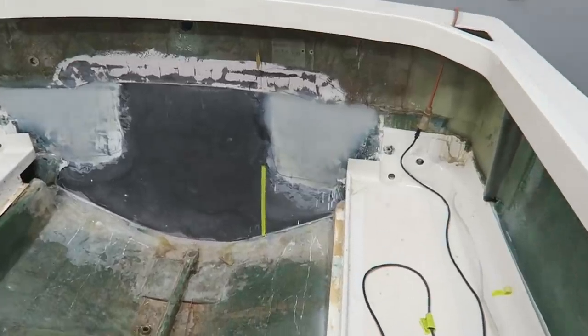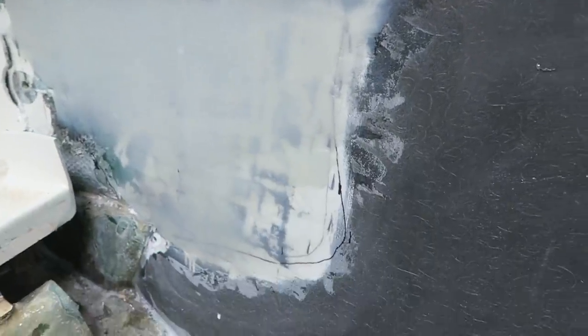At the end of the day, I used the same amount of silica in that half-size batch, and surprise, surprise, it actually worked this weekend. Because I used a smaller batch size, it took less time to get the silica incorporated. And because I was working with a smaller volume of epoxy, there was less thickness of the mixture sitting in the bucket. The thicker the mixture, the faster it starts to set up, because it creates its own heat and heat accelerates the curing process. Having half the volume gave me almost twice the working time before it started to get warm in the pot.